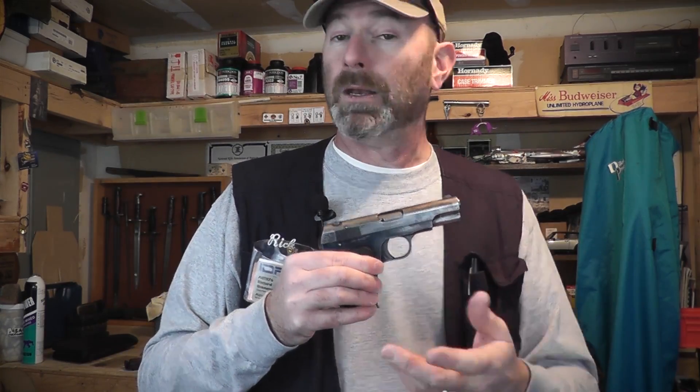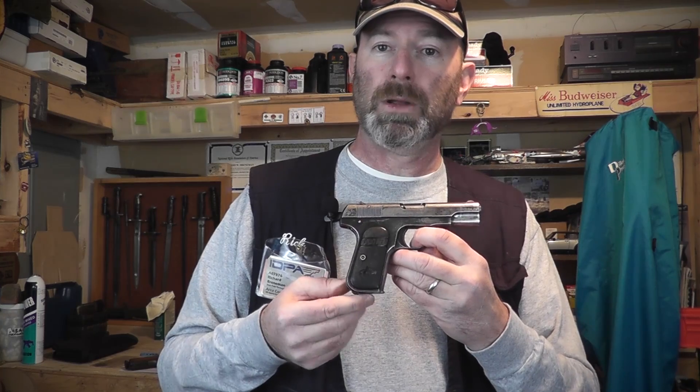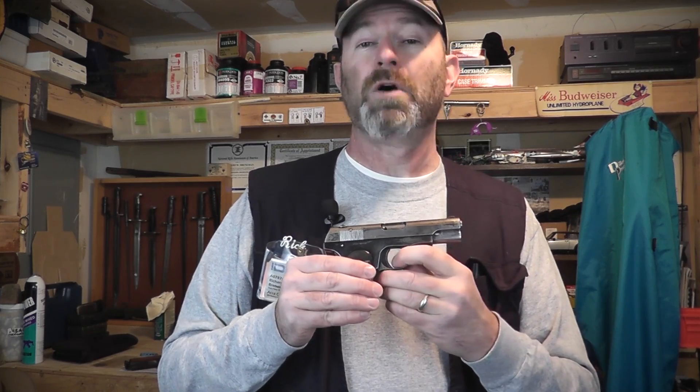Check your muzzle crown, or on a revolver, the face of the cylinder. Look for little distortions that can adversely affect accuracy. It made a huge difference — just that little bit of material intruding into the bore made a huge difference. We'll cover it again in the future, see if we can find that round. And if you're going to shoot the match and want to shoot your bug, you'll find out here whether we'll be calibrating to either the bug standard or the revolver standard.